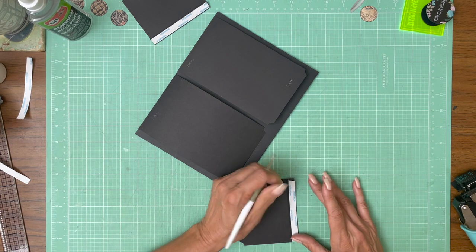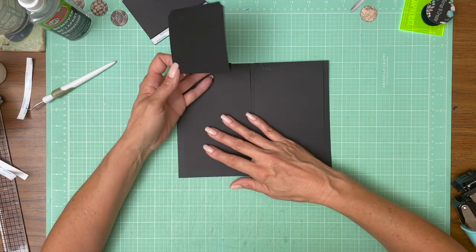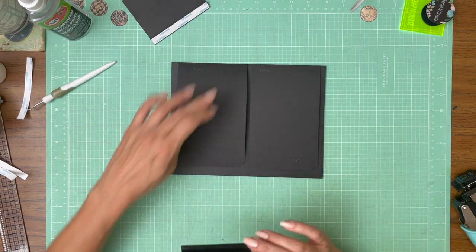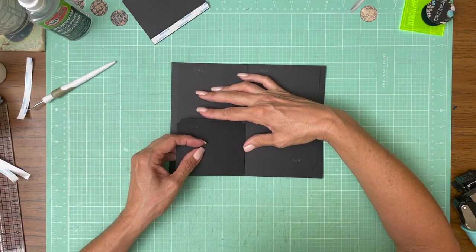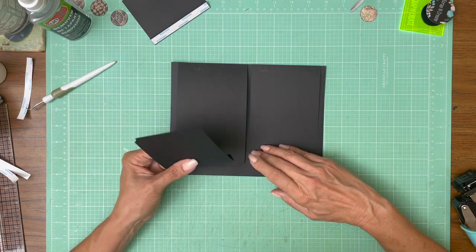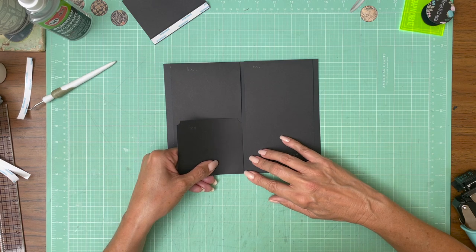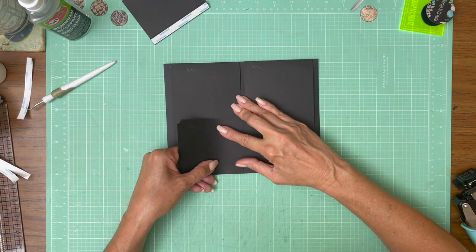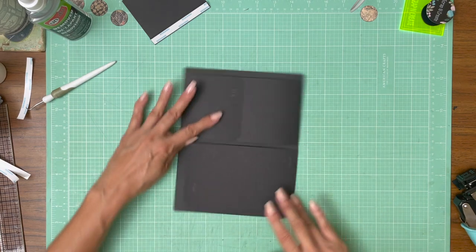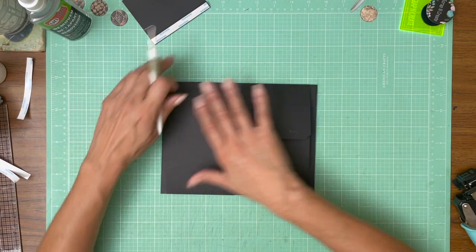Now when we go to install this, I didn't do any marks. What I really want to do is line it up with the flap below it, because that's what your eye is going to get drawn to — whether or not these are aligned, not so much the straightness of the line, but if it matches what's below it. It'll create that visual straight line you're looking for. So I'm only applying one tip of the hinge here and kind of using it as a pivot point to line up with the flap below. I want to line off of the inside, because that's where I think your eye is going to get drawn to. If it's slightly off, I'd rather have it on the outside than the inside.